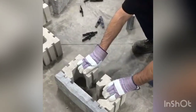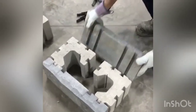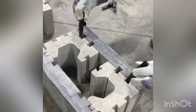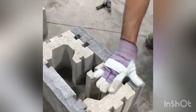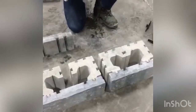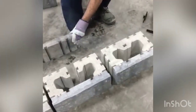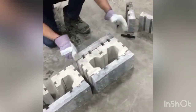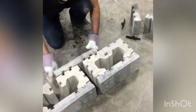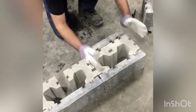Double-sided wall installation. Take your single-sided block, take a veneer of the same size, simply put it at the back. Take your clips — preferably put them on the outside of the block, one per unit — and that gives you your double-sided wall. When building with the Next Block, just like the tandem structural units, every veneer goes to make a single piece. You never want to interlock veneers with other structurals. Always one piece together.